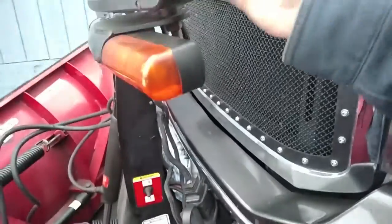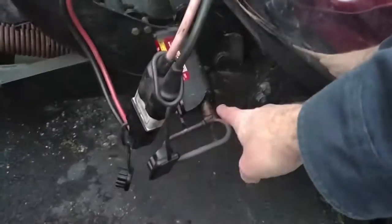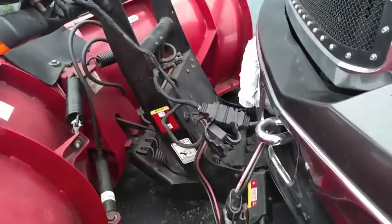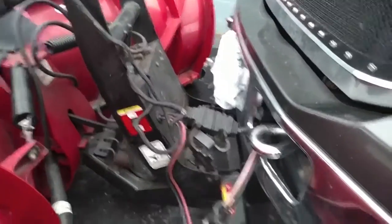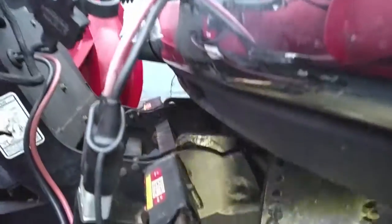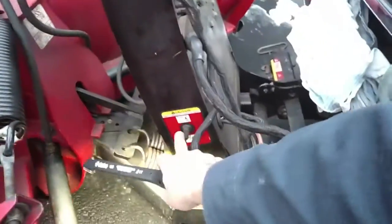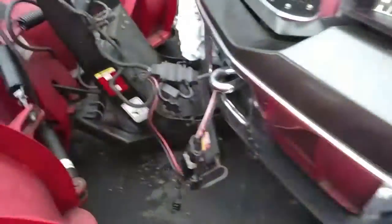So we're going to lift — I'm watching where I'm at, I'm not going to be anywhere near here. Lifting up, you're going to hear it pop and you're going to see it down here. See that pin pop out? And now we're just laying right down — it's gravity pretty much. It's laid right down. I didn't even have to push down on that lever — the gravity and the weight helped us out there. Now those pins would have been right here in this hole and over there too. Now you see we're laying down, so I'm no longer really engaged to the truck. Just for good measure I'm going to push down here, make sure we're all open. I can push it a little by hand — now what we're ready to do is totally disengage.